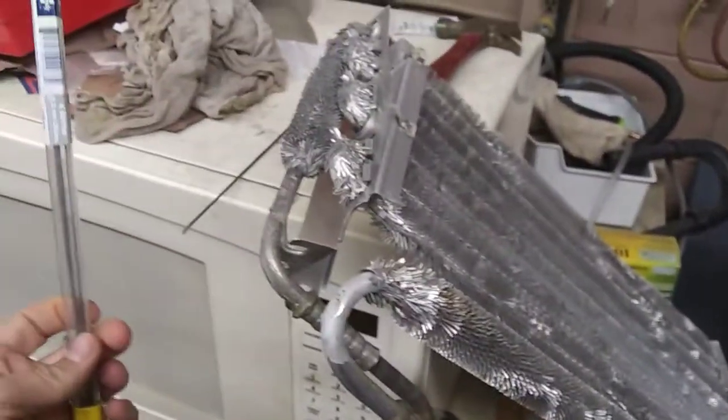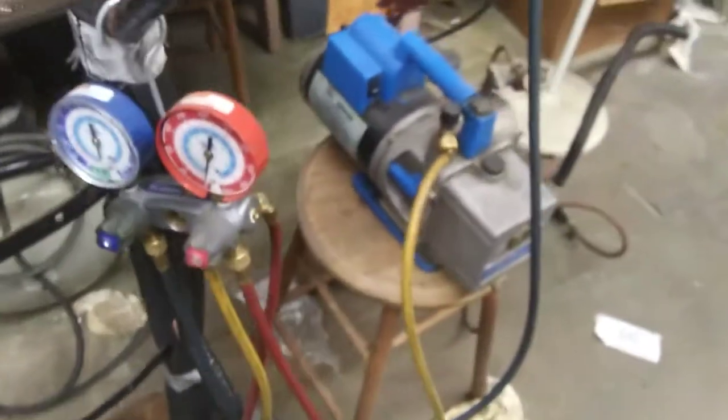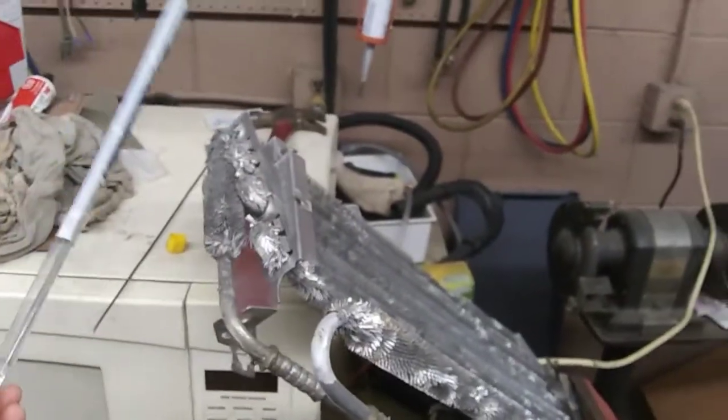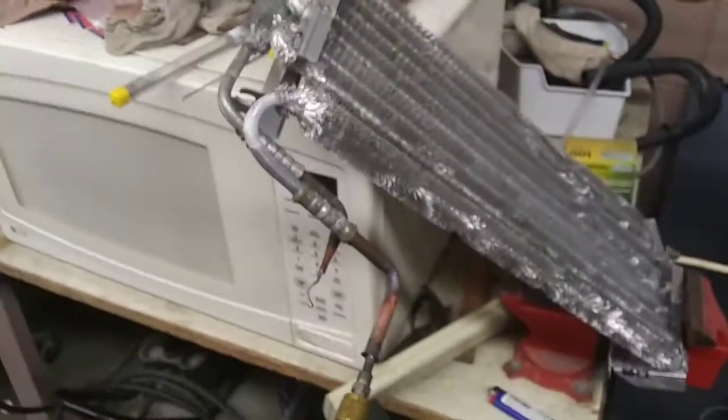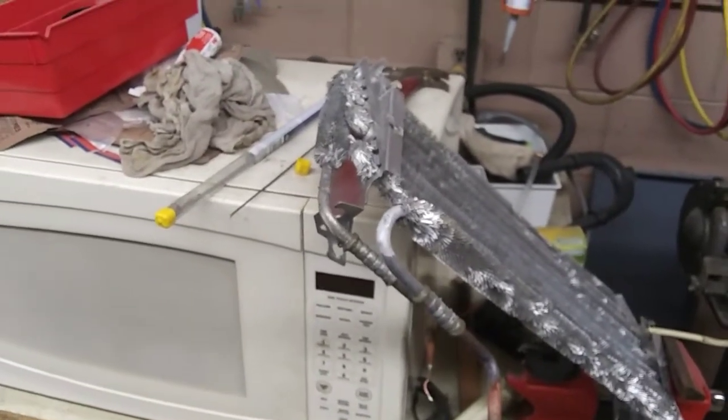Is there anything else I can talk about with this stuff? You're going to want to stay cool on the side of your heat. I'd guess propane or map gas would work; obviously this old B tank of acetylene did the job, though it might even be a little hot for this application. For what this cost me — $20 — I get four rods of this stuff. For just patching a hole, you might use an inch, half inch, probably even less. Once you finally get good at it, you might use a quarter inch and be fine.